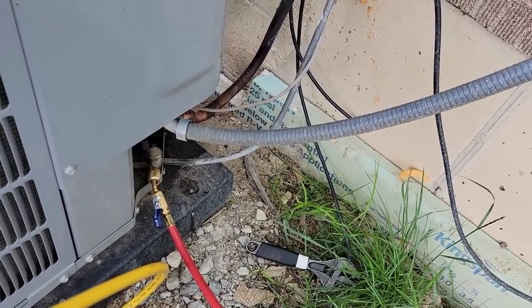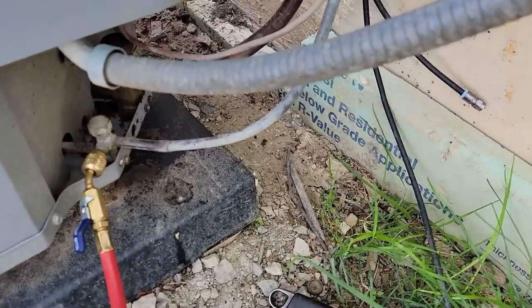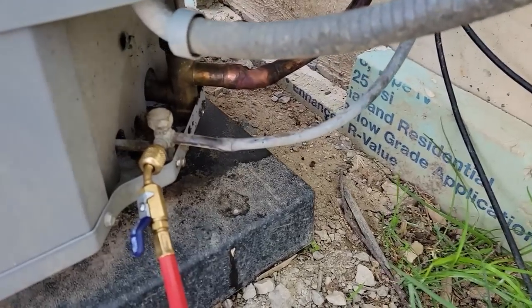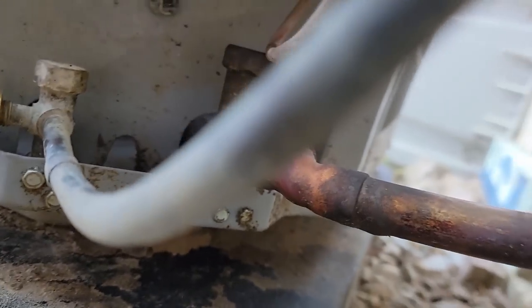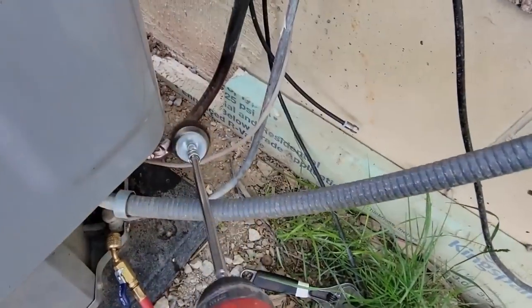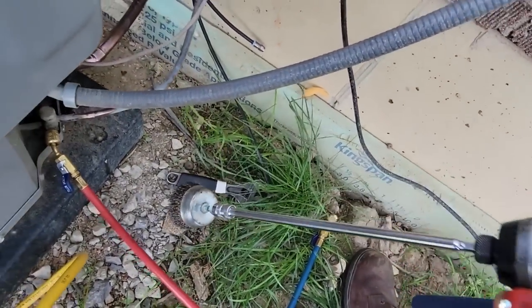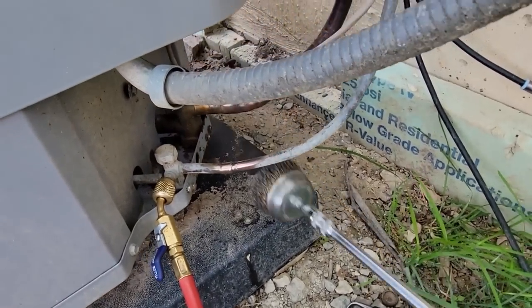We're just repairing the solder joints that were being eaten up from the sulfur water and didn't get quite hot enough to suck into the pockets like they should. Looks like 7/8. That looks like 3/4. That might have something to do with it. Used our monstrous long extension here, so this allowed me to get in here completely to all these different areas and get that cleaned up.